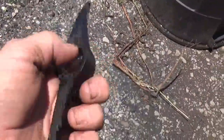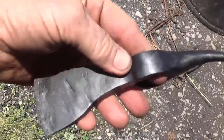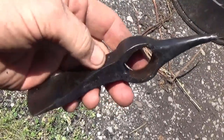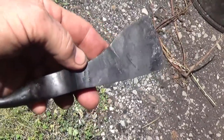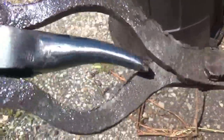Here's the tomahawk head after it's been cooled. See that black coating — that's oil. If this had been in the charcoal or coal fire, there would have been a lot more slag on here. Another reason for using oil, especially used motor oil, is you can case harden it — there's a little bit of carbon left in that oil that goes to the outer edge and provides some extra hardness. The only thing that's really hard and brittle is at the edge; if you hit it with a hammer you could break it. I'm going to wire brush and get this all clean again, then show you the right temperature for stress relieving or tempering. Once it's cleaned back to shiny metal, you can see the blue on the tip — once you've done that, you know it's not going to shatter if you hit it with a hammer.